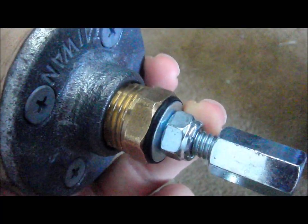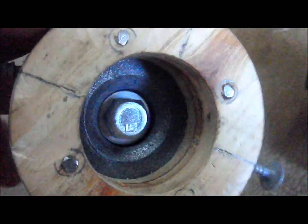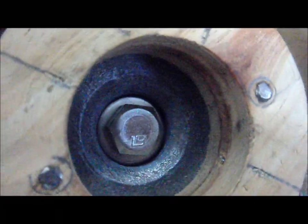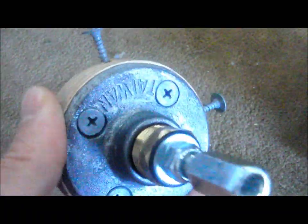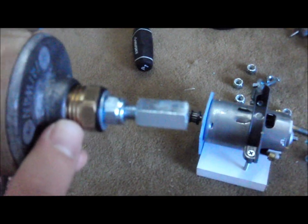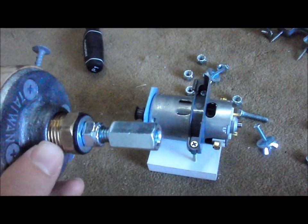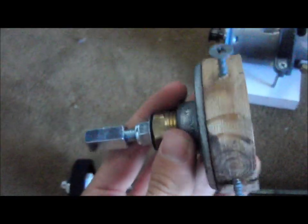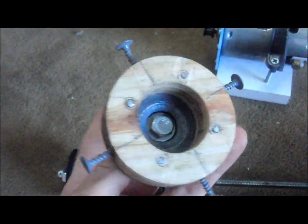For the chuck, I upgraded the plastic plug to a brass plug for more strength, and I got new hardware so now the work piece can be put further back into the chuck — there's now a bolt head instead of a stop nut, which allows for more depth. There's the same rubber washer setup, one on the inside to keep it from spinning, and then a coupling nut because I use a bolt now and couldn't run the threaded rod all the way through. The coupling nut also lets me take off the chuck if I need to disassemble something.